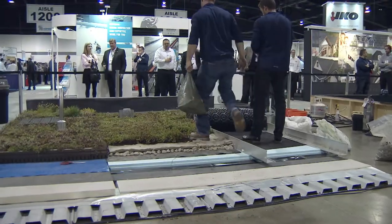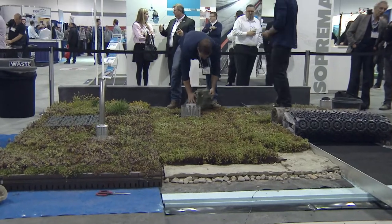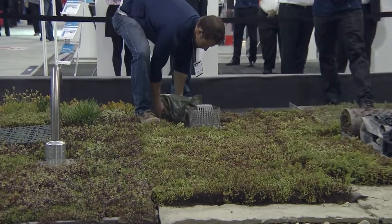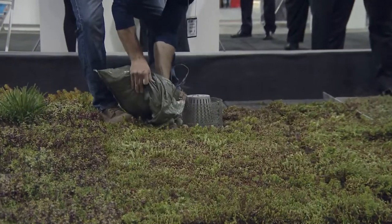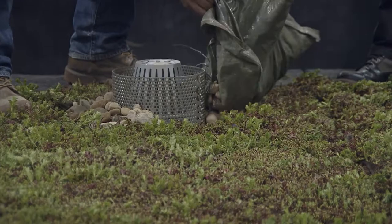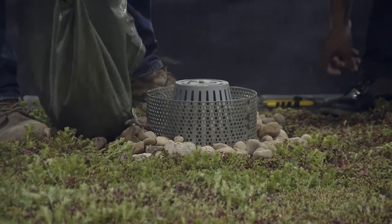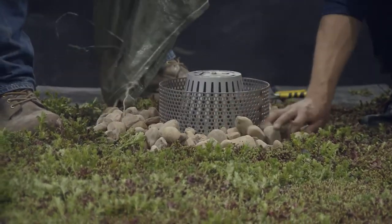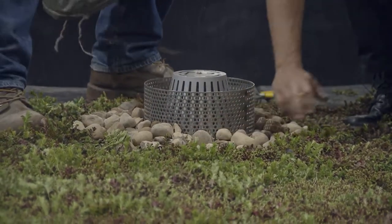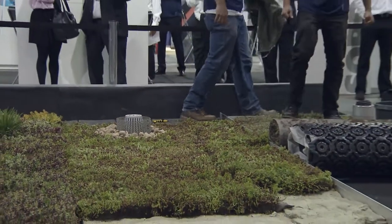The stone ballast is filled in around the roof drains and any penetrations — such as a gooseneck or pipe — filled up to the height of the plants to ensure the plant edges are nicely covered. All the various components are engineered to function as a system: when it rains, the mat absorbs the water, the excess percolates to the mineral wool which also absorbs and stores it for later plant use, and the rest drains through the stones into the roof drains. That completes the thin layer mat installation.